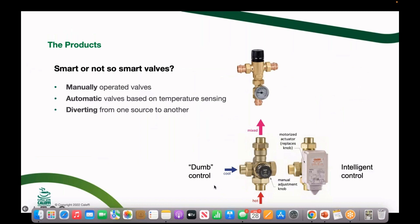When we talk about smart valves, we're talking about a valve that has the ability to sense and react to conditions going through it — it could be a thermostatic cartridge that sees the temperature changing from the system return or the boiler going up, and makes a correction. The thermostatic mixing valve — the one shown here with the gauge — is going to stay within a couple degrees of your set temperature regardless of what's coming in from the return or boiler reset curve. It's the go-to valve for both plumbing and hydronic applications.